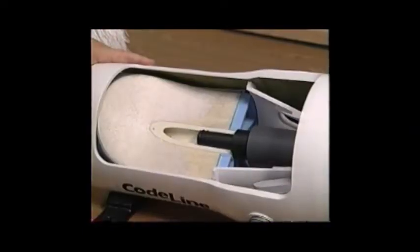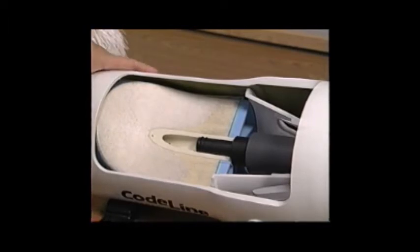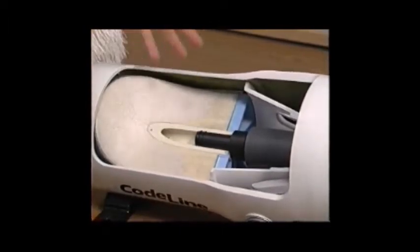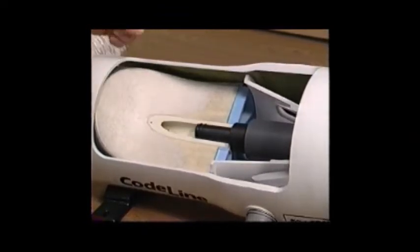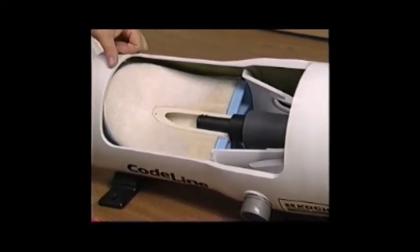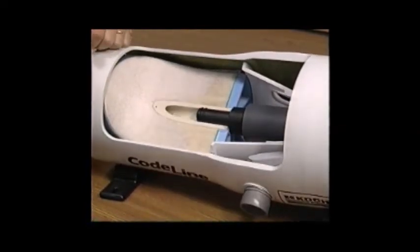This is the reverse osmosis membrane vessel. It comes in these long plastic tubes, but basically this is a wrapped membrane, a sheet that's been wrapped up around itself to save space. The water will pass through this membrane much like it would pass through the cell wall of a single cell. That's why we call it osmosis, but it's reverse osmosis since it's passing through the cell the other way.